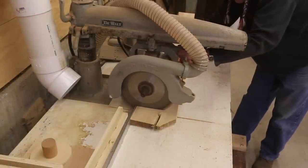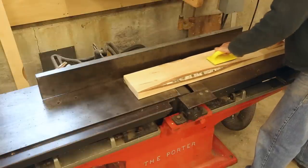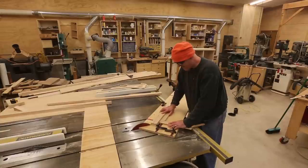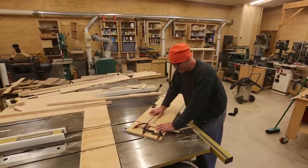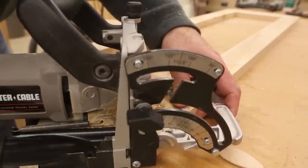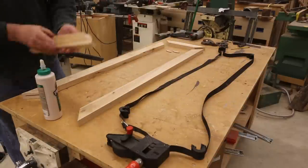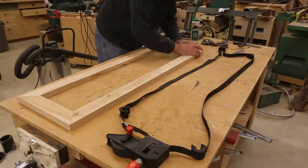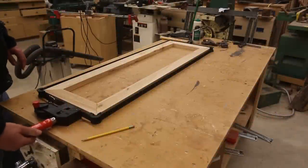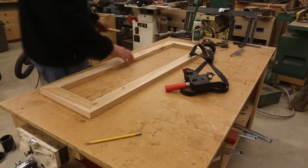I've got a piece of birch that I can use. I'll joint and clean it, get it nice and flat and straight, cut it into strips, and miter it. I realize I have enough room to do a biscuit at the miters on this frame, so I'll do a biscuit at each corner, which will help keep everything flush and make the joint much stronger. A band clamp works really well to hold the frame together as it's gluing. Now the glue is dry — I find it usually glues itself a little to the table, so a tap with a hammer will unattach that.